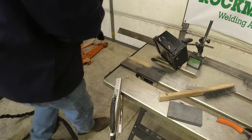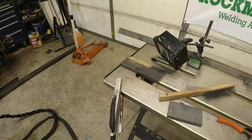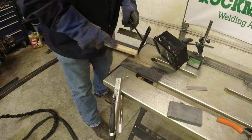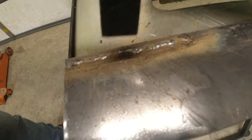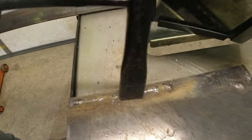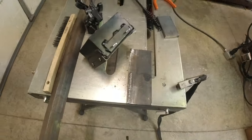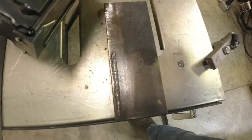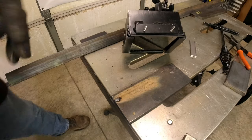That's also why we wear a respirator for all the smoke. Something else you'll need if you're running flux core is a chipping hammer and a wire brush. There's slag with flux core — you've got to go through and clean all of it off. Also, your stick-out length is very crucial with flux core. I had some porosity — little holes in the weld — I think I was just a little too close.